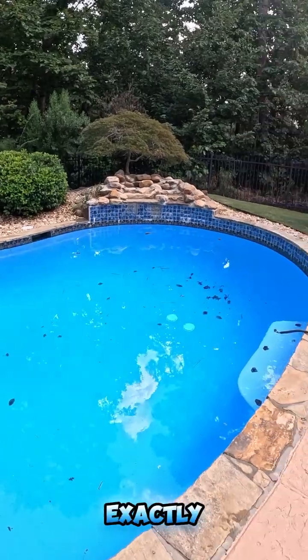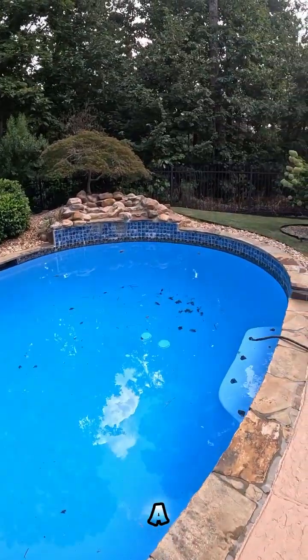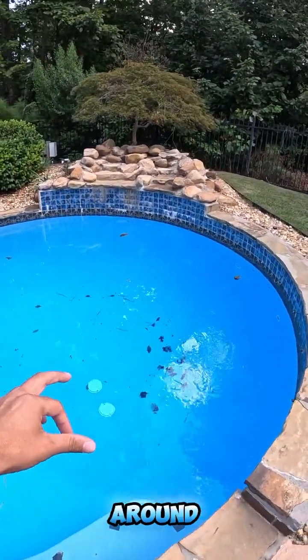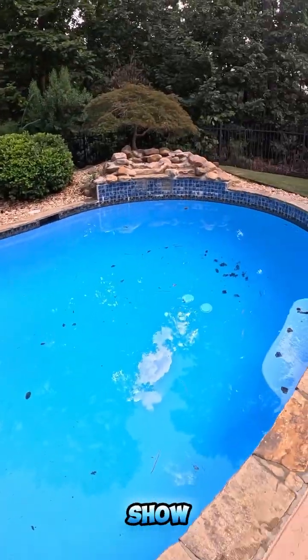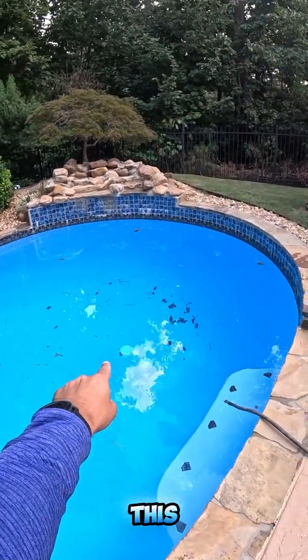Because that's exactly what we found with this pool today. So again, if you ever see a pool that's got blue epoxy paint or any kind of epoxy paint like this, one of the first things you're going to want to look for is any kind of separation around these two different materials. I'm going to pull up the GoPro video and show you guys exactly what we found — you'll see where this pool was leaking a ton right around this drain right here.